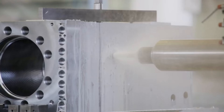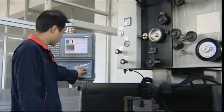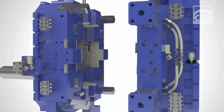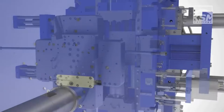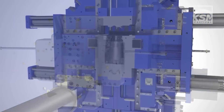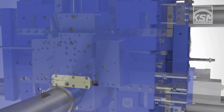The manufacture of a die involves precision machining, where the mold cavity is carefully cut and shaped to the specifications of the part being cast. Dies are often made in two halves — the stationary cover die and the movable ejector die — which come together to form the mold cavity. Depending on the complexity of the part, the die may also include cores or inserts to create intricate shapes and internal cavities.